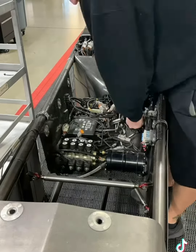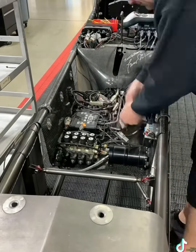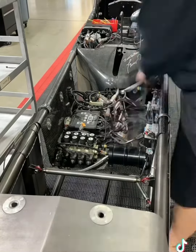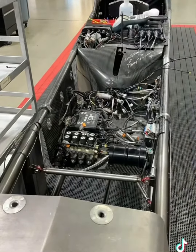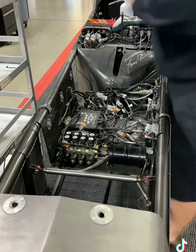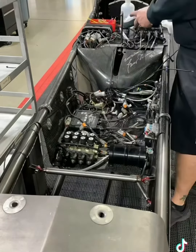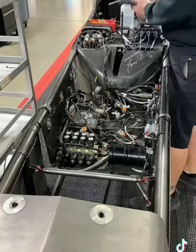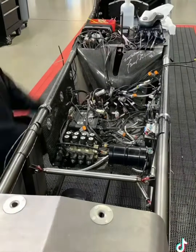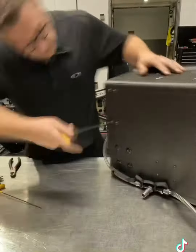Now keep in mind, there's airlines in here, there's hydraulic system, there's electronics, there's starting switches — you name it, it's in here. Generally how I do it is, on my airlines I use colored zip ties. That way, if you're in a rush about something, it's pretty simple — you just kind of idiot-proof it. Put the damn colors together, that's where it goes. On the electrical stuff, I'll use a label maker, I'll mark each side of the connection, and then I usually take some clear heat shrink or something like that.